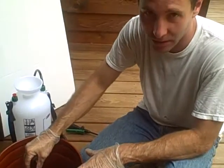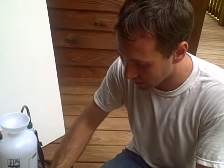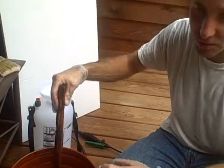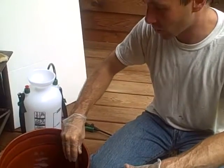Typically, when you open a fresh pail, you're going to want another empty five-gallon bucket. The easiest way to mix it is to pour them back and forth into each other, because there will be a thick layer of stain at the bottom — it's like iron oxide and really hard to mix up well. If you don't mix it well, you'll end up with a light-colored portion and a really dark portion. I've already mixed the stain up pretty well.